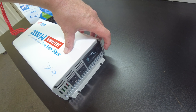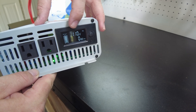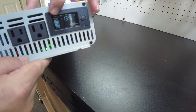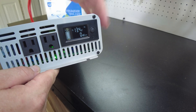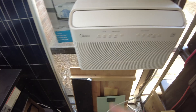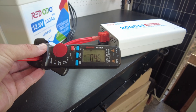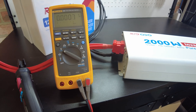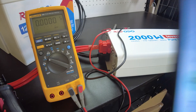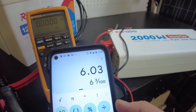Let's turn this thing on. The display is nice and clear — it's cycling through DC and AC voltages. We've got 110 volts AC and 13.4 volts DC at zero watts. The battery level indicator is there, but don't pay attention to it since it reads voltage and will be inaccurate. At idle we're measuring 0.46 amps at 13.4 volts — that works out to about 6 watts idle consumption, which is well under the claimed less-than-9-watt spec. Impressive.